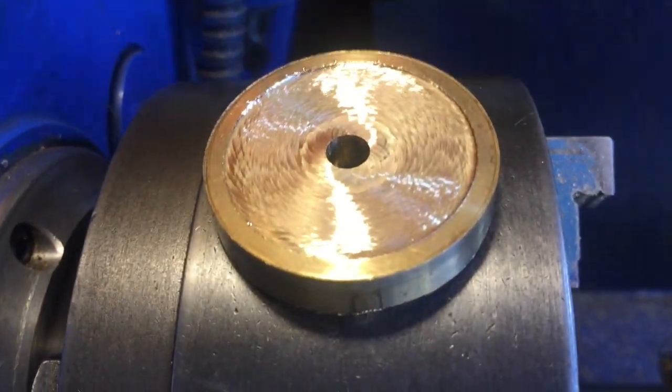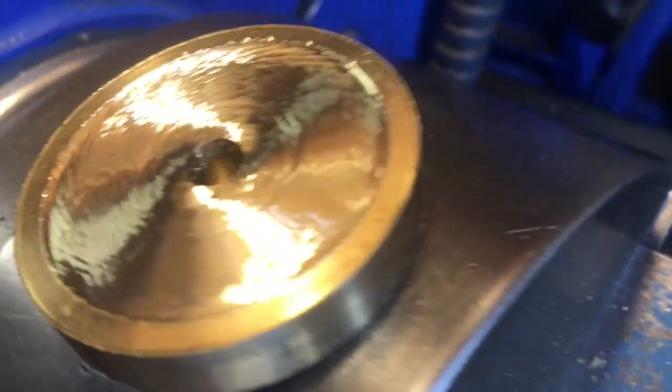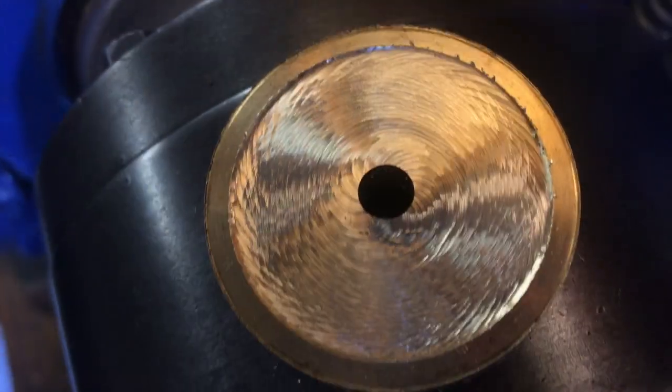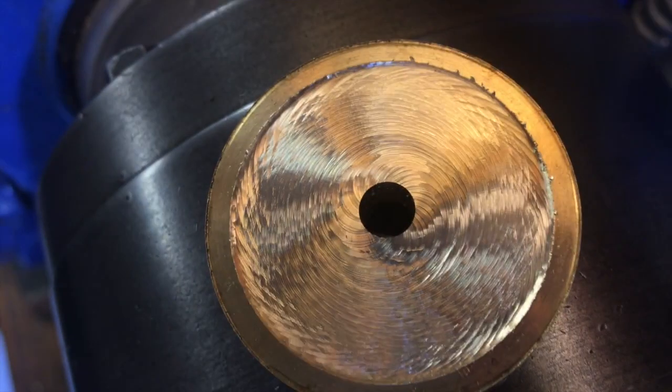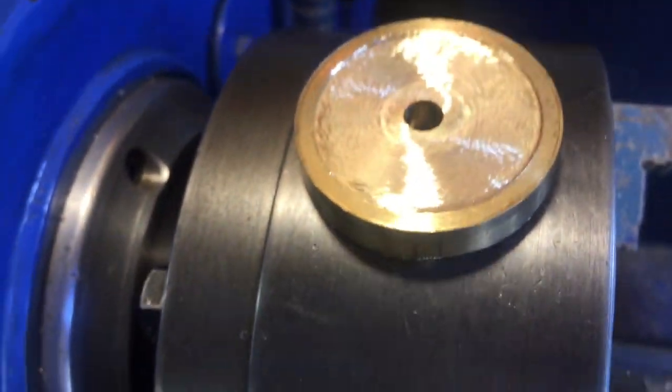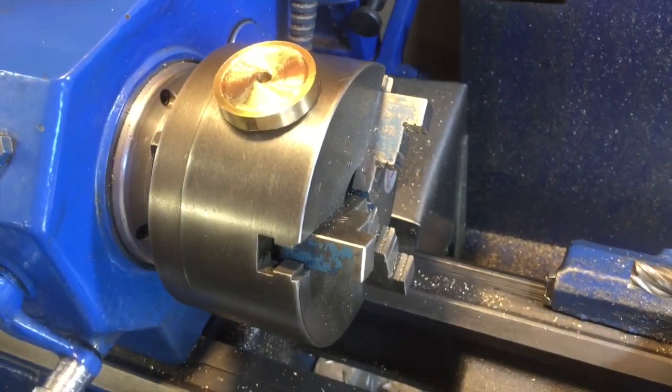The end result was rather disappointing — there's chatter across the surface, which I wasn't expecting. On closer inspection I decided the tool wasn't quite concentric. It wasn't so much that the 14 millimeter hole through the center of the collet was off center, but that it was slightly loose, and when you do up the grub screw it goes off center. I'd bored the 14 millimeter hole a little too big, and the shaft itself was actually marginally below 14 millimeters. To solve this I decided to re-bore that hole out to a larger size, insert a bronze bush, then re-bore that — and the question was how to make it concentric.